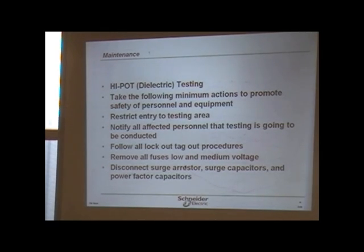However, when you're doing that, you should be wearing your proper PPE, because in the event that this son of a gun here, for whatever reason, is shorted to ground, when you go to close this, you're closing in on that fault. That's why it's dangerous just to go up there and start closing stuff or opening this. You don't know. What you got to keep in mind, on something even this far down the line, is why those arc flash analyses are very important.